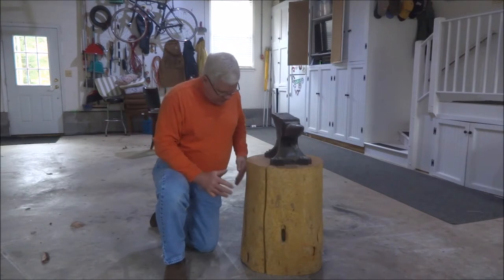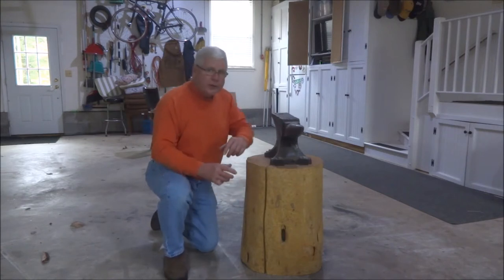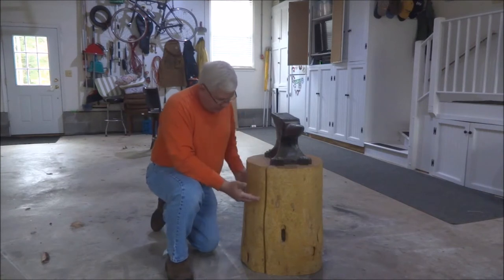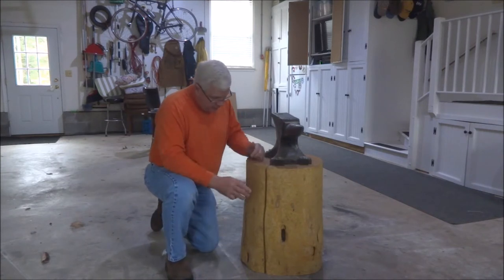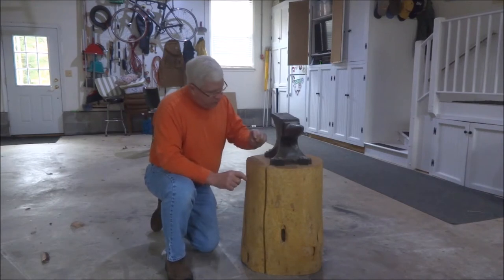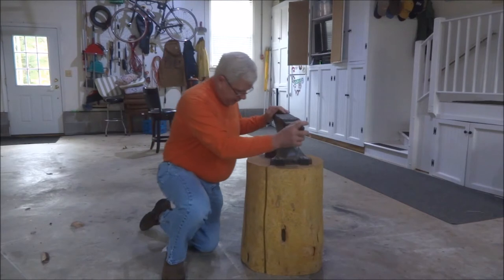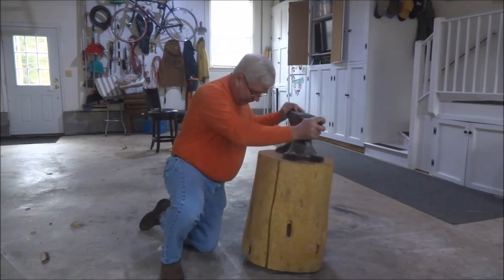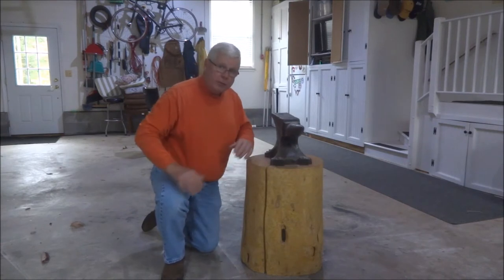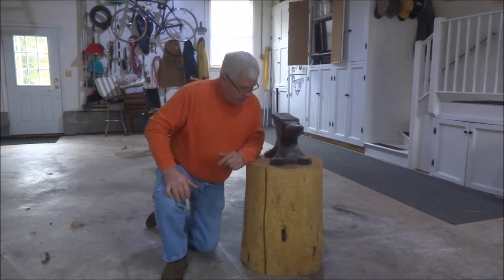And my plan is to take a piece of 4-inch by 1/4 flat bar. And what I'm going to do is make a little U and then put a caster on each side, just enough so that it's just a shade off the ground. That way I can put the caster underneath like that, tilt it back on, move it around the shop, and when I'm ready to use it, I'll just pull the caster out, and so on and so forth. So I think that'll work all right. And so we'll show you that project, and let's just get to it.